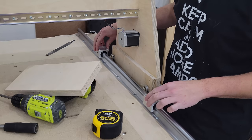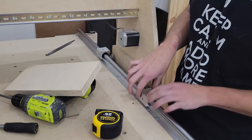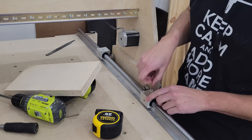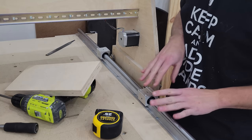So I've got my linear bearings right here and what we have on the side and the top are little adjustment screws — that's to take up any slop. I noticed one of these out of the box was a little bit sloppy; you could hear it clanging around. Just tighten those up until they're just a little bit snug and it takes that all away. Now they glide perfectly.